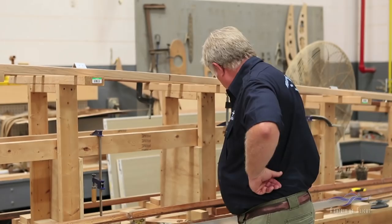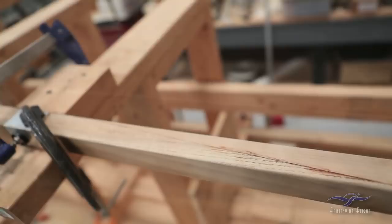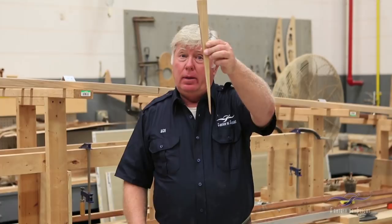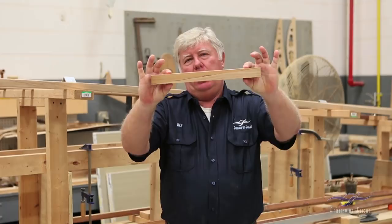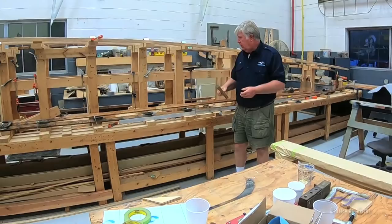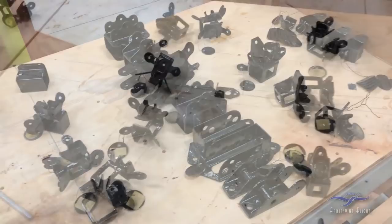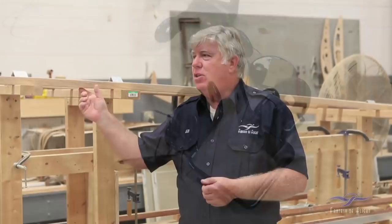On this airplane, the front half of the fuselage is ash, which is a hardwood. The tail section from here aft is spruce. So we had to put a big splice joining those two pieces of wood. How we do that is we cut a really long diagonal in both pieces of wood and then put them together and glue them. I had to build a jig here to hold it and keep everything straight — just the gluing process was a bit tricky to get done. Then they had to be hand sanded to the point where the fittings that slide on here — which support all the vertical members and cross members that make up the box of the fuselage — all had to fit. That took a day of sanding per longeron, so I spent all last week just sanding these to fit the fittings.